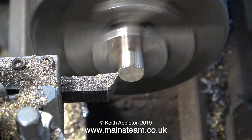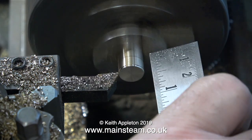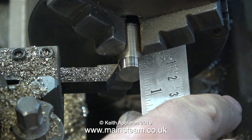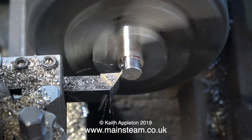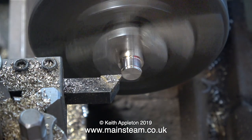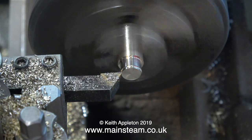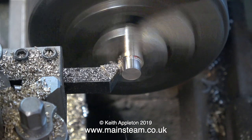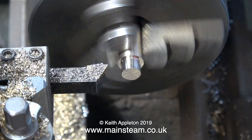The darker red stuff is horrible to machine — try and avoid that. A quick health and safety warning: while the lathe is still revolving I'm using a ruler to mark a line on the work a quarter of an inch in. This is a terrible idea — I'm not saying you should do it this way. It's best to stop the lathe, then measure the distance and mark it with a felt tip pen. Measure twice and cut once. I've stopped the lathe and I'm checking that the distance I'm cutting is a quarter of an inch, and it is. In this next clip I'm stopping the lathe a lot because I'm using a micrometer — I would never use a micrometer on anything that is revolving, that really is just asking for trouble, and it would also wear the micrometer over time. I put in these health and safety notices and most of the time they are common sense, but it's best to be reminded now and again.